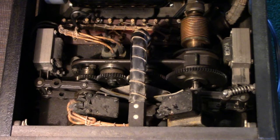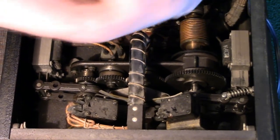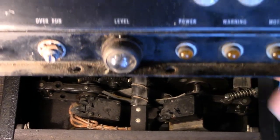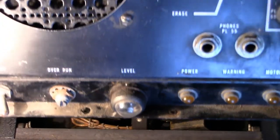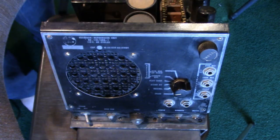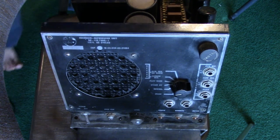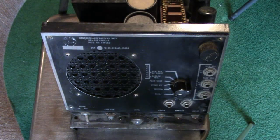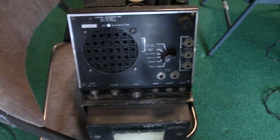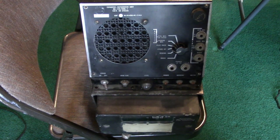So, by using no paper capacitors, but only more reliable mica capacitors, and by coating all the electronics with a certain material that shields it from the air to prevent it from corroding with time and rusting and oxidizing, you get a device that is extra tough and lasts very long. Therefore you get a recorder that is just 1 year shy of being 70 years old that still works on almost 100% original parts. That is nothing short of remarkable.